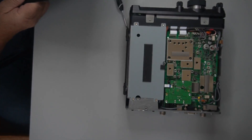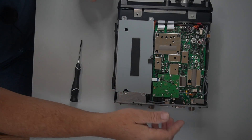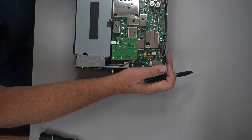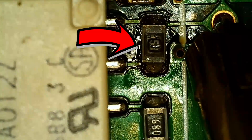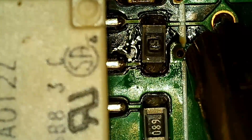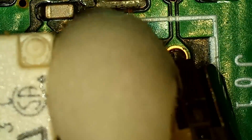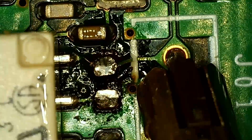There we go. The area we're going to be playing with is right in here. I'm going to set this up the way they have it in the picture I'm looking at — I'll put a link to that for you guys later. The one that's probably bad is this one right here. The red arrow is showing the bad resistor — it's a 150-ohm resistor.